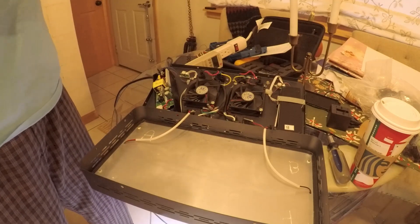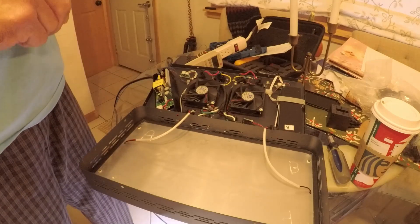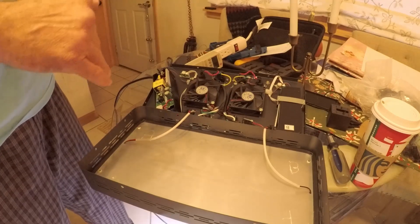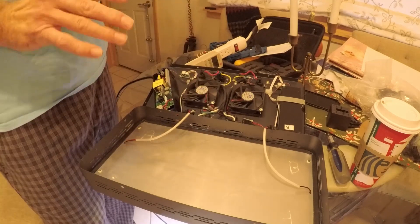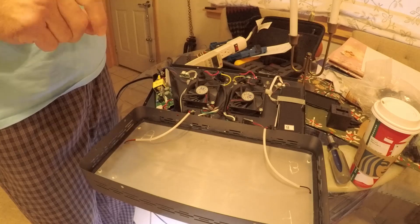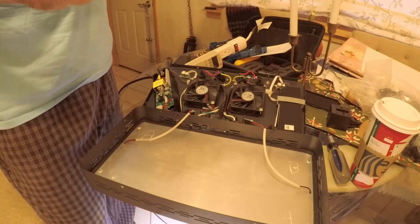What you want to avoid: if you turn it down too low — in this case for this light fixture that's under five watts — say for example if you go down to four or three watts, the LED white channel would just flicker, and you don't want that. That's not going to do you any good. So you want to turn up the wattage slowly in small increments with the adjustment screw.